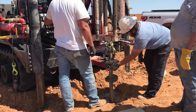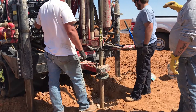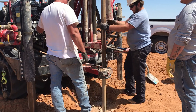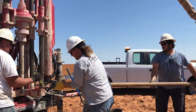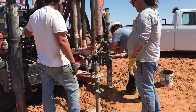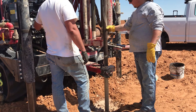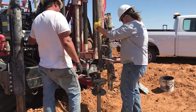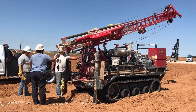At the end of this video, I'll show you a lab report. Right here we're using a wiper rubber — normally this would go on top of the BOP on a drilling rig, but since there's no blowout preventer here, we just stick it below the tongs to wipe down the string and keep fluids in the hole. We're coming out of the hole, laying down, and fixing to rig down and move to the next borehole location. The rig is track-driven and remotely controlled — nobody rides it.